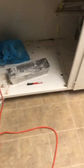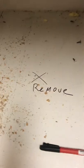I've made marks at the bottom to cut out and add support where the existing cabinet is. You must remove this section, cut this out flush, and add another backer in here to support the existing countertop.